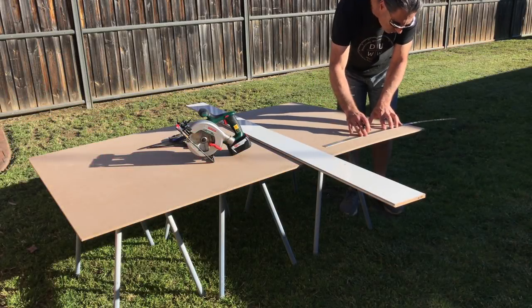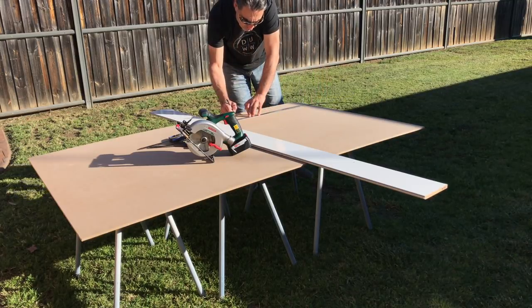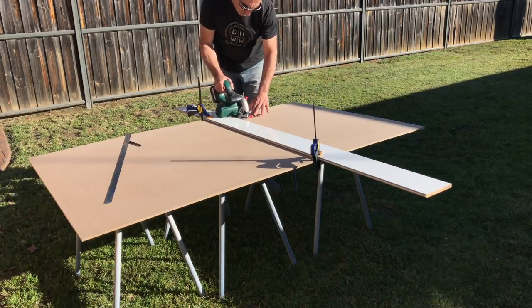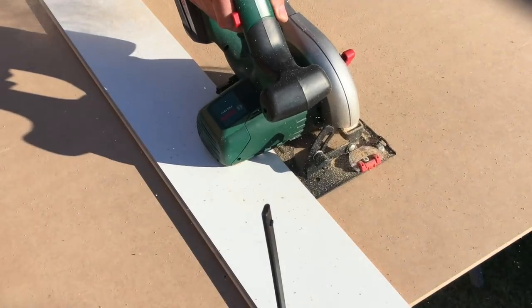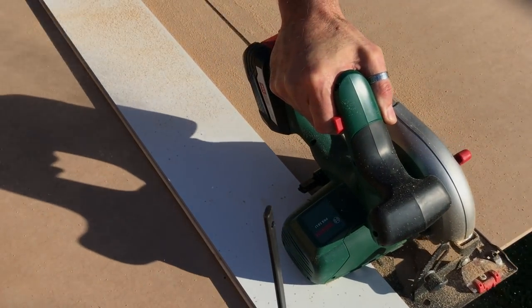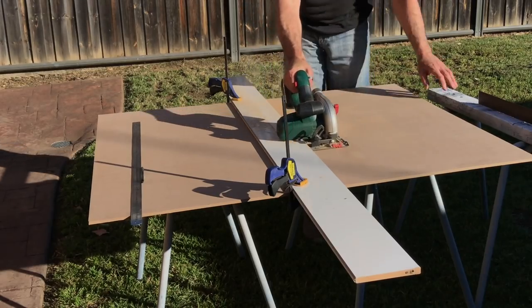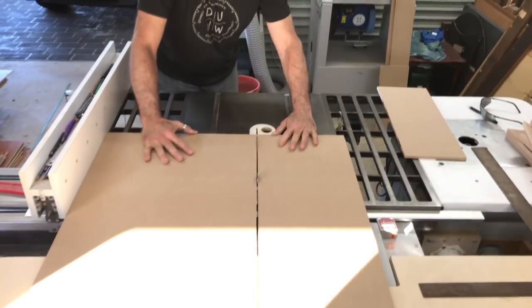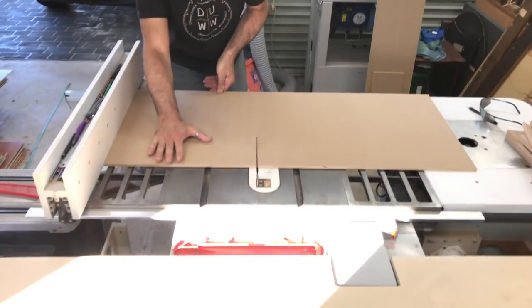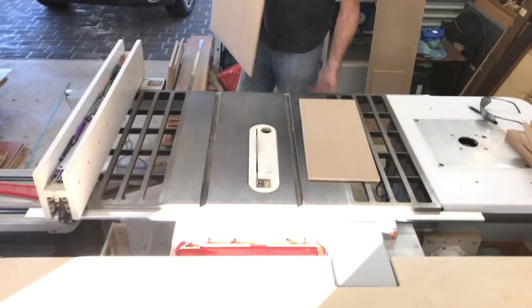This project starts with breaking down a large sheet of 9mm MDF into smaller, more manageable pieces that I can then take to the table saw to cut down further. There are eight main pieces for these two boxes, roughly 500mm square, and the leftover is cut down to narrower strips that'll make up the rail and stile profile of these boxes. You'll have to excuse the shaky video here — I didn't realize this until editing time, which was obviously too late to reshoot.